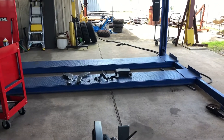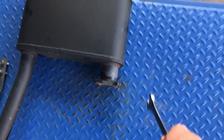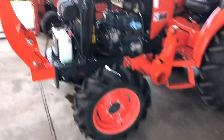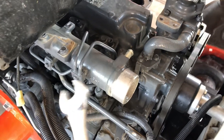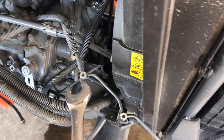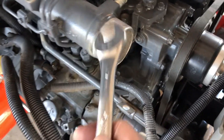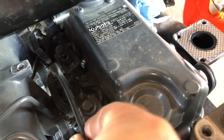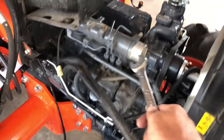We got all of our brackets off — that's everything over here. I removed the muffler just for the sake of the video; I really don't think you need to, but I'm actually going to drill and tap right here to put my exhaust gas temp meter. Coming over to the motor, you really have to remove a fair amount, because on this particular model the intake is on top of your injection pump. So all the brackets come off, take your fuel rail off — you can just fold it right over, don't even have to fight these rubber fittings. Then we are going to crack our lines, take these Phillips heads out, remove our glow plug wires, and then we'll have easy access to all of our injectors. After that, intake manifold, and then we'll get to the pump.